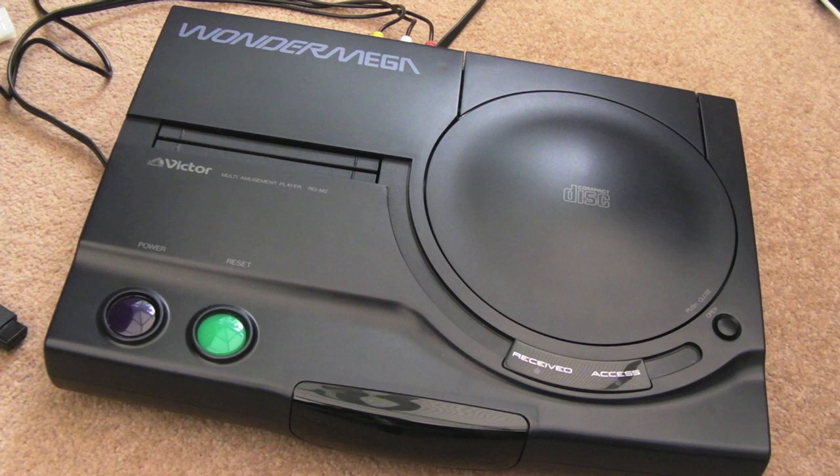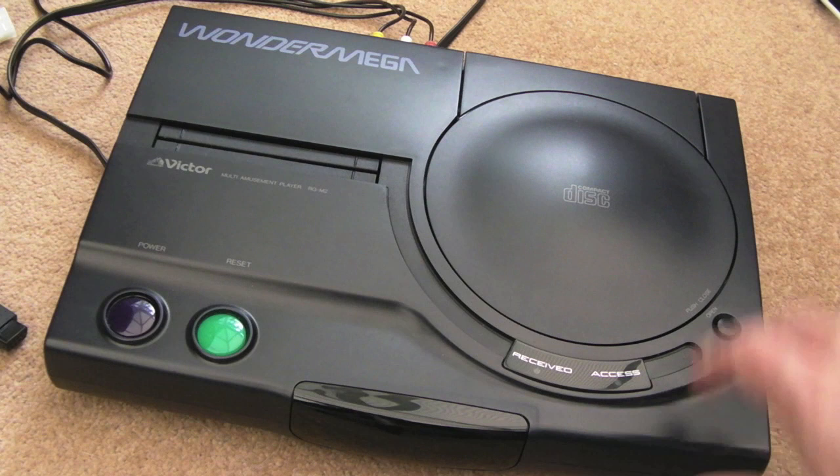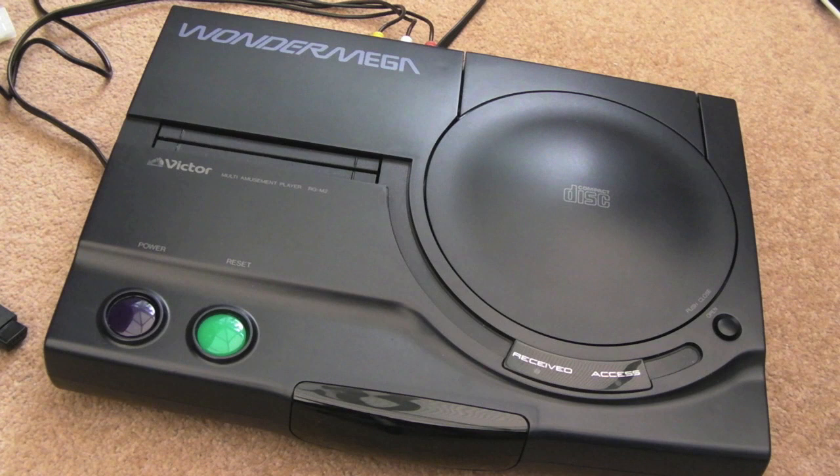At this point in time the CD audio seems fine. She said just maybe try testing it after it warms up for a bit. It's frustrating when you get a problem like this — I'd prefer it if the audio wasn't working, because then I could start scoping things and very quickly work out where the actual issue is. The board pictures show some corrosion, but it's not as bad as many systems I've seen. It's very light corrosion, but there may be some areas of bad corrosion — we'll have to have a really good thorough look around the board.